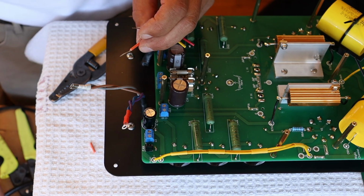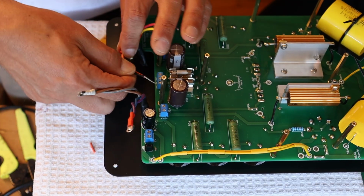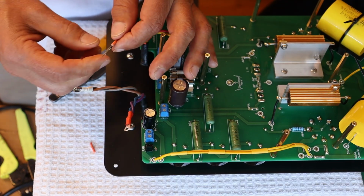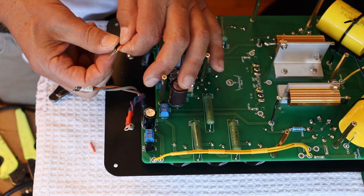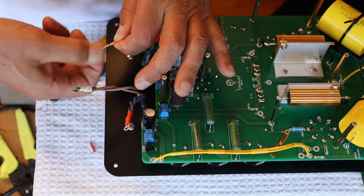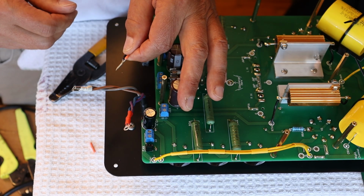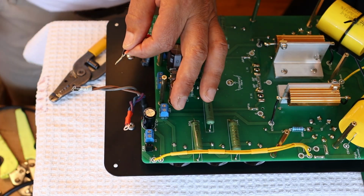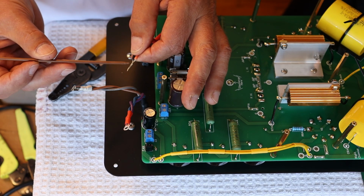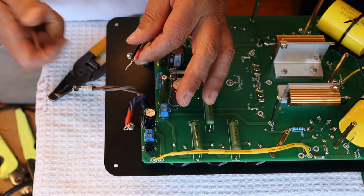So we're going to be fairly cool, around 350 C, which is 660 Fahrenheit, and we're going to see how that works. We're also coming in like this, so we want to just check the fit, and the wires are actually running really good together. So we're going to make a gentle little cross here, and a little twist. And when you do solder these together, you don't want to have a large clump or a large solder ball on them because they have to fit in that blue terminal. Yes, and thanks for reminding everybody, Charles. So look what I've done. I've only done a very gentle twist, and I have a really tight bundle. You can't have a bulky bundle or they won't fit into the terminal.